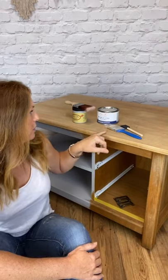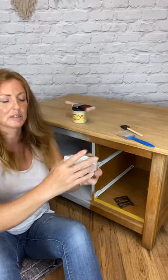This piece didn't need sanding overall, but the top I have sanded. There was some staining that mostly came out, but I wanted to sand it back because I'm going to use the No Pain Gel Stain in pickling white and I'm going to wipe it back. I wanted to sand it back to bare wood because I'm going to wipe it back. You can use it over existing finishes and leave it on without wiping back, but personally for this piece I wanted to go for the wipe back.